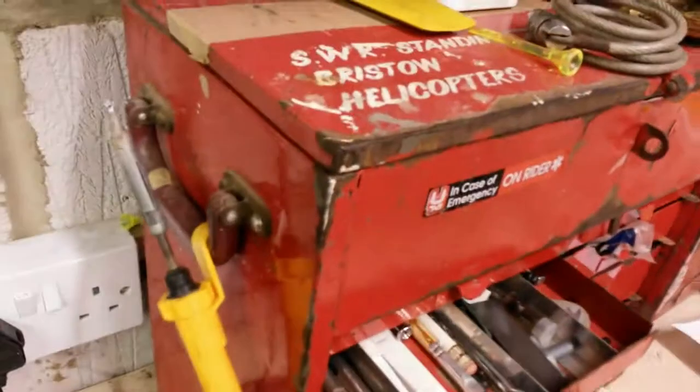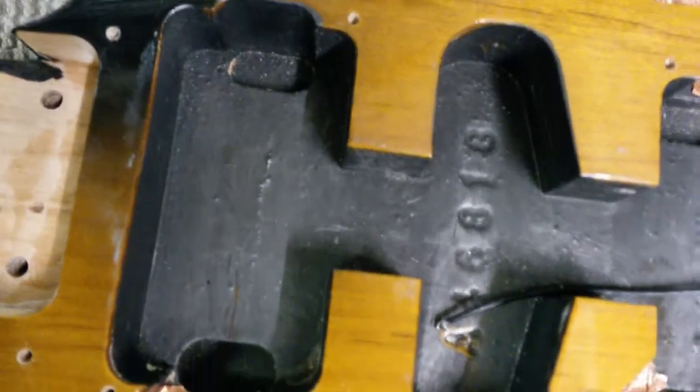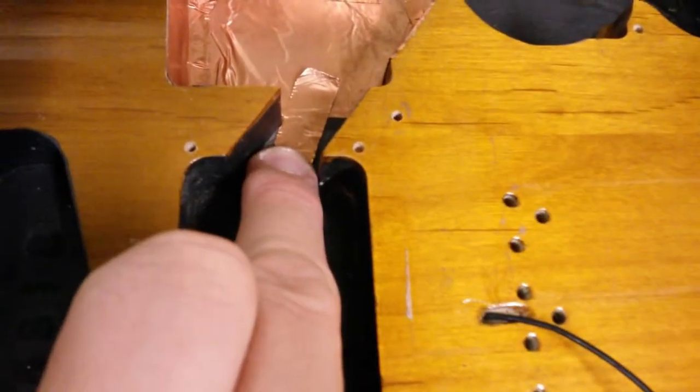just make sure it's all joined up. So with the soldering iron, my finger is now in frame, I'm just going to do some little spot solders on various places, just to make sure it's continued, got some good continuity. The only other thing that's a little bit devious is obviously I can't do it between paint and copper.